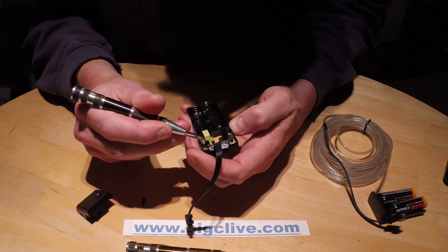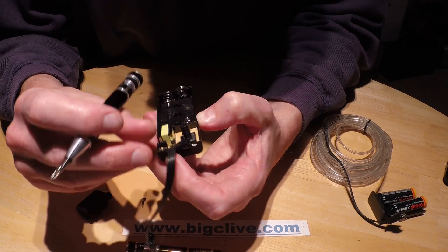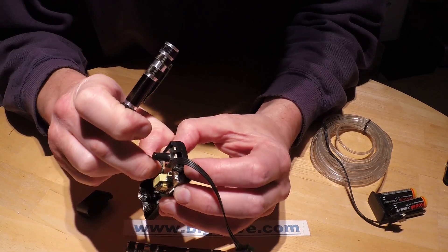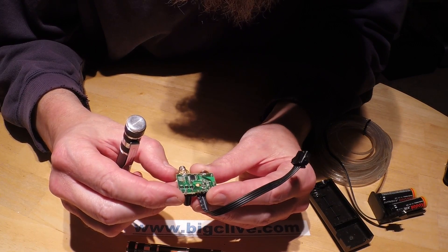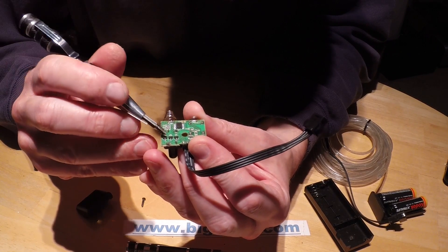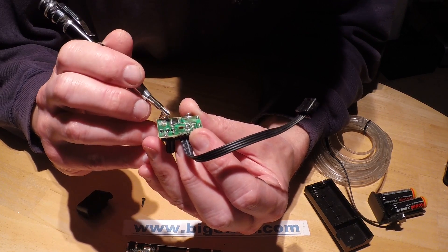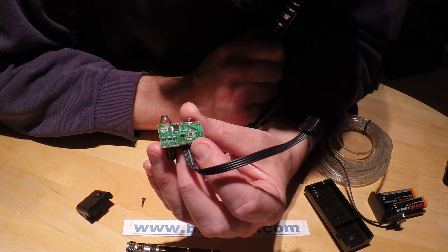So there's the transformer — I'm guessing that's the main transistor that drives the transformer. There's a big clicky button. The battery contacts are mounted directly onto the board. It's actually a little chip — one of those numberless chips. What's the bet it's a PIC-12 again? There are the three triac-type components with three resistors feeding them. Either this chip is also turning on and enabling this self-resonant circuit, or quite possibly the chip itself is actually providing the frequency that drives that transistor. There's really not a lot to it.